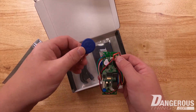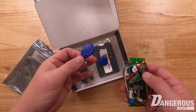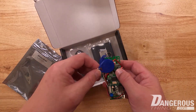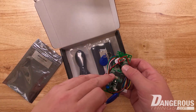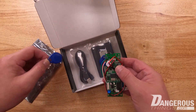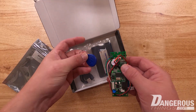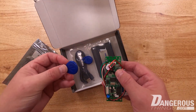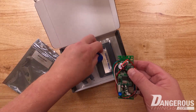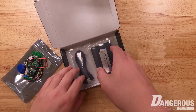That's very interesting, meaning if you don't like the key fobs, you can make a key fob, a card, or a work badge as the master tag for adding new tags. You just set a jumper setting and that lets you program the master tags. Essentially, scan the master tag, then scan a tag you want to add, then scan again, and that's added. You can also set up a clear tag — scan the clear tag, scan the tag you want to remove, scan again, and it's removed from memory. So it has its own built-in management system. Very cool access device.